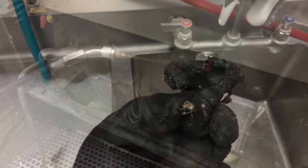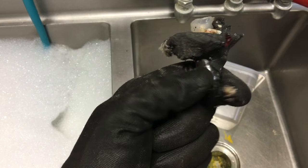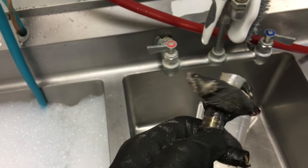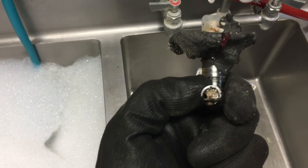Okay, so the next door neighbor, they were getting water inside of the newer one, and look, the elbows get plugged. The little plastic elbow they put on there. That drain hose goes up to the bottom of the drain pan. That's the sealer. I just pulled the whole thing out, and then you'll see they just get plugged.